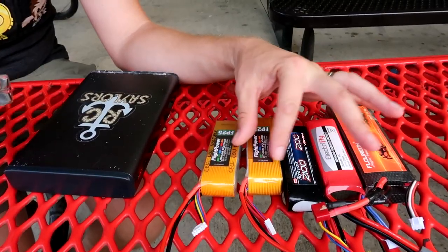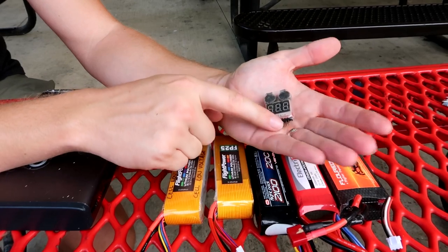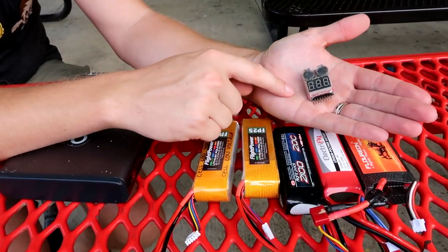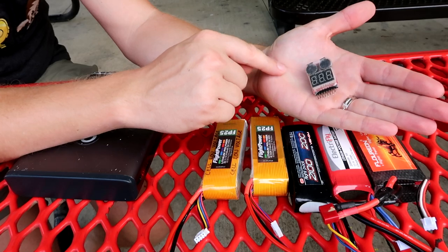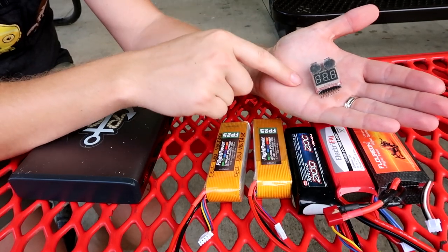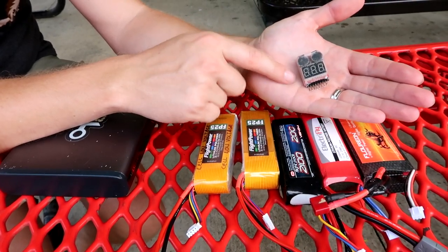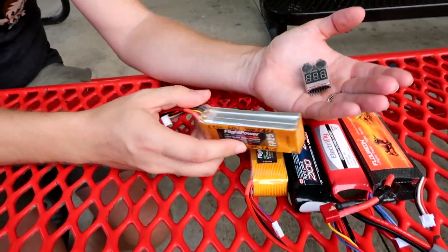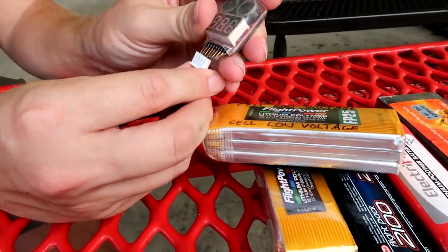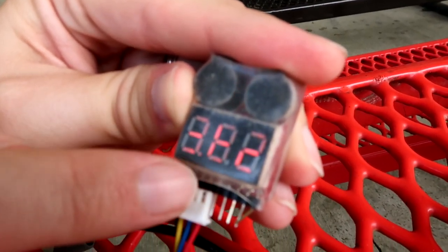What I have here is a bunch of bad batteries. This is a very used and abused lipo alarm — I use them until they completely die. I'll link it in the description box below. If you use a lipo battery for planes, drones, race drones, trucks, or cars, you need a lipo alarm. This is a lipo checker and alarm — a very useful tool you need to own. Let's take a look: this one, just by looking at it — other than the fact that I wrote 'cell low voltage' on it — you'd have no idea there's anything wrong. But when you plug it in, we're getting an alarm. That's telling us the first cell has an error.